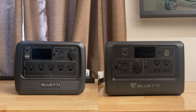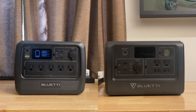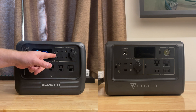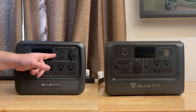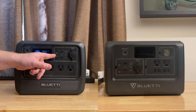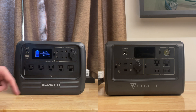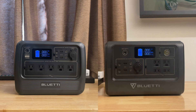The controls between the PS72 and the EB70S are nearly identical. The PS72 has two buttons on the front and one button on the rear for the light. The EB70S has three buttons on the front. On the PS72, the first time you press a button it turns the screen on; the second time turns the actual output on with a green light. If the screen has timed out and you push a button, it just turns the screen back on. On the EB70S, the unit does not care if the screen is on or not — pushing a button at any time will activate or deactivate that particular control.